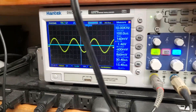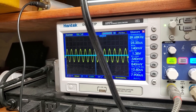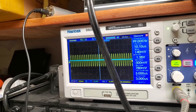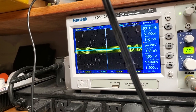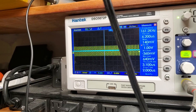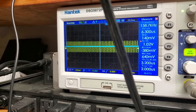This is 10 kHz frequency. Let's increase it and see the upper limit — sweeping through 20, 30, 40, 50, 60, 70, 80, 90, 100, and 200 kHz. Back to 100 kHz and slowly increasing until 1 volt. The upper frequency limit is 160 kHz at the minus 3 dB level.